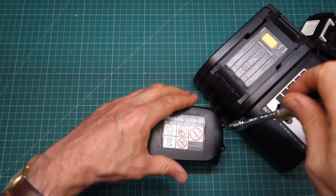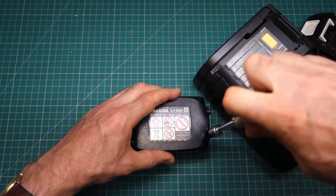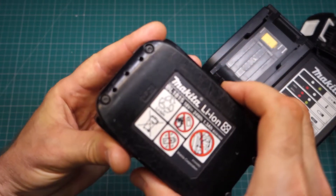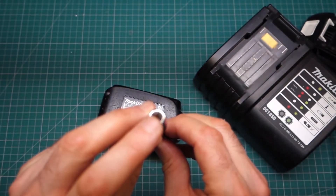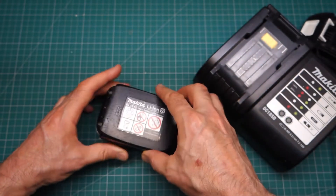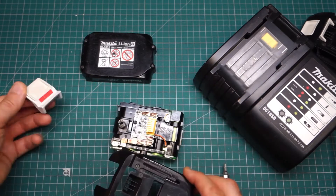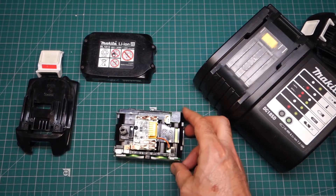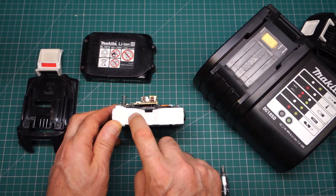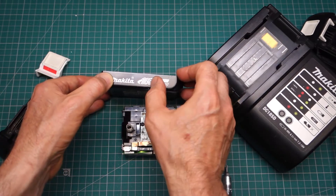I have been into this pack before because I wanted to know the parts I needed to buy. We've just got four Torx bits in the bottom — they're actually security Torx bits, so they've got the little hole in the end. Very quickly we are in — top and bottom. That's just the release mechanism. We have a printed circuit board on top here which does all of the smarts and the balancing. And we have one, two, three, four, five lithium ion 18650 cells, obviously adding up to the nominal voltage of 18 volts as denoted on here.